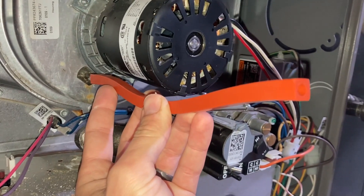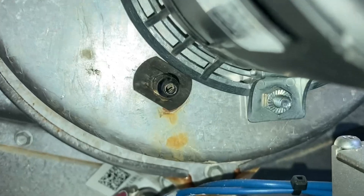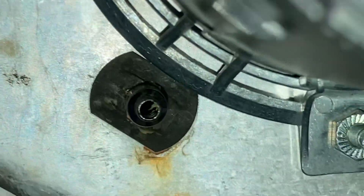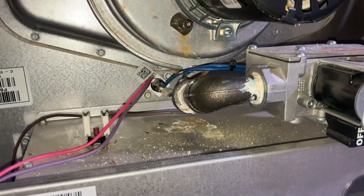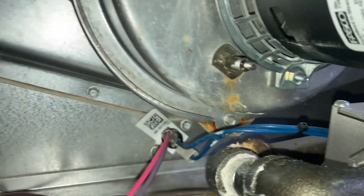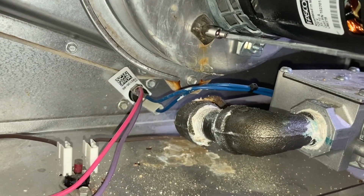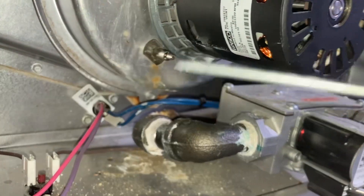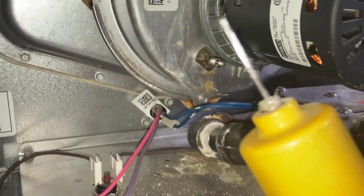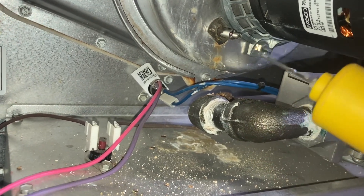When I did that, there was complete back pressure. I looked in this port and you can still see there's gunk in there, but at least now it is open. It was pretty much calcified — water residue that was blocking this port. I stuck in a screwdriver that fit perfectly and worked it in — you could feel the blockage in there. Also got a sports ball pump, which fit perfectly in here, and just blew it out.